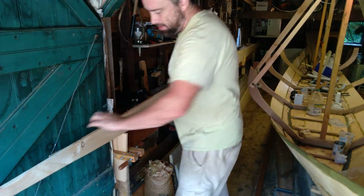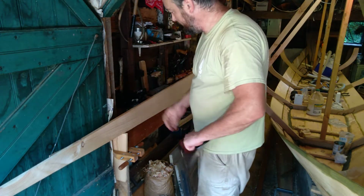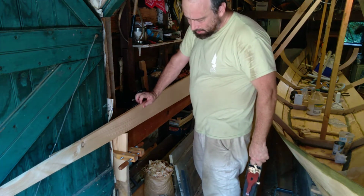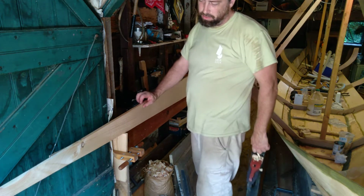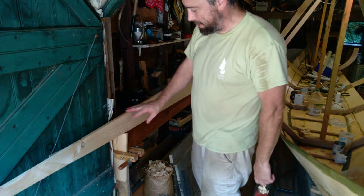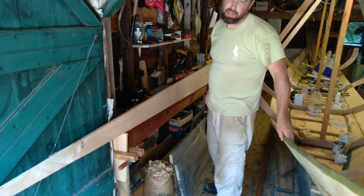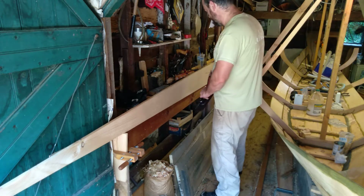And like I was saying before, I've got this little jig set up so that I can do this on the planking bench. I've got the clamp on the bench. This shop is a little bit too short to build a 21-foot dory, so I'm running this plank right past the edge of the bench, which would be plenty long for most dories. Most dories are like, say, 16 to 18 feet, so the most you'll need is around a 20-foot plank.